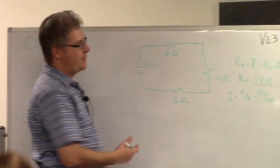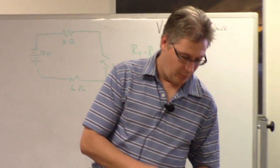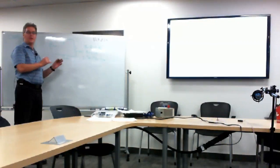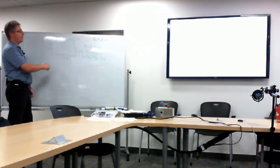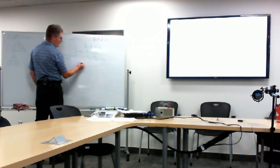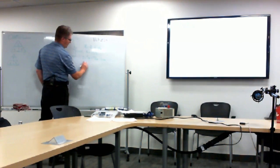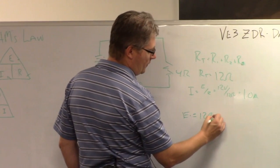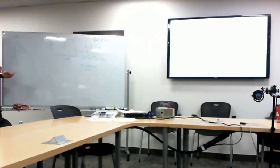Generally speaking, this is going to be the easiest circuit, and you will have one of these on your exam. They might give it to you where you just have to figure out the resistance or current one way or the other — they'll tweak it. They might not give you the voltage but tell you it's a 1-amp circuit. If you know two values, you find the third. For example, voltage equals 12 ohms times 1 amp, giving us 12 volts.